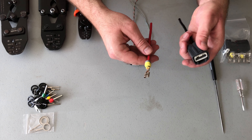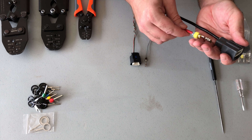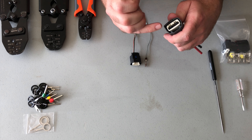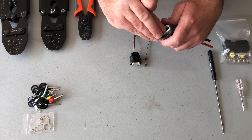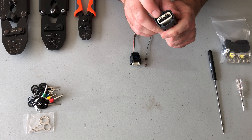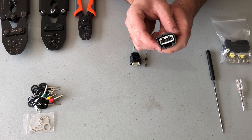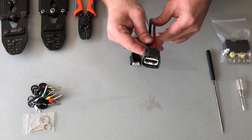To assemble it, all you have to do is make the crimp as you see it here, and then make sure the white terminal retainer is at its slightly popped-up midpoint position. Then the seal can be installed in the housing until it clicks, and to lock it in place you simply push down on the terminal retainer. This terminal connector is now fully assembled.